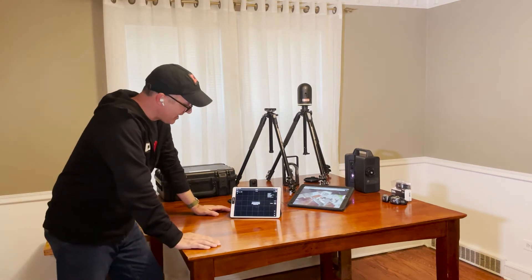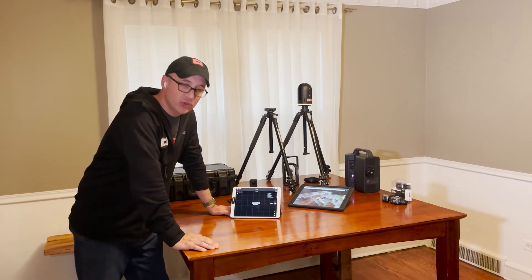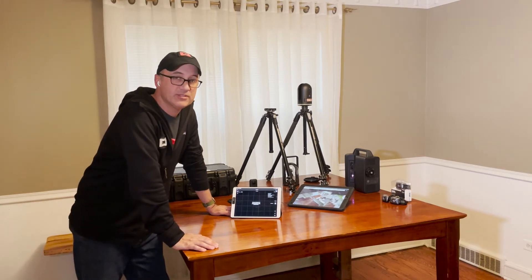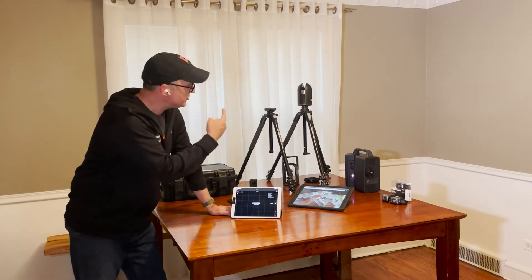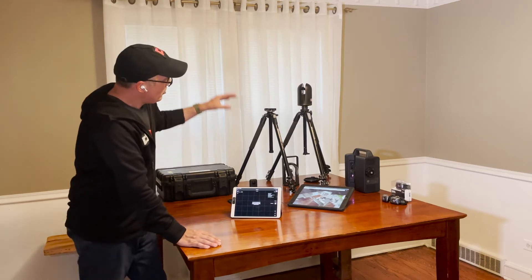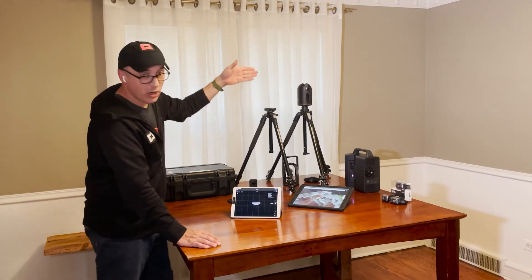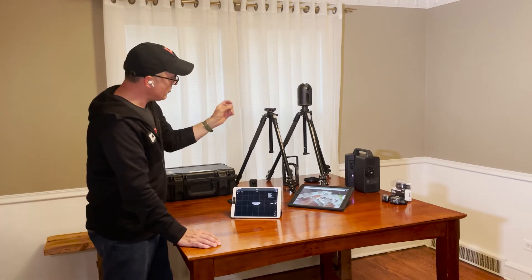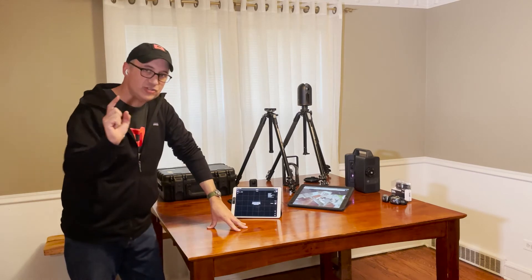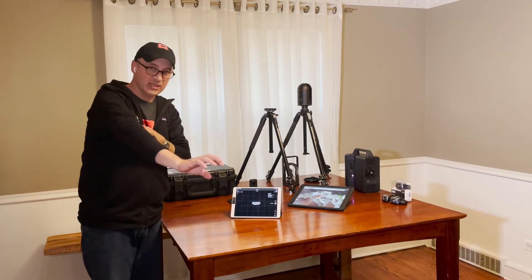It's just about four and a half minutes — not very long. It has improved from previous iterations; long-time users will note the speed has improved dramatically. It used to be upwards of eight minutes for one capture rotation; now it's down to four, including transfer and alignment time. In review, it's doing small motions — snapping a picture using all three cameras, doing a move, and repeating. This rotation is just snapshots, and after the full rotation it will do the laser portion.